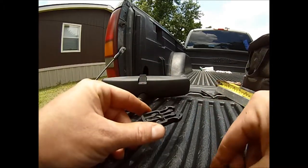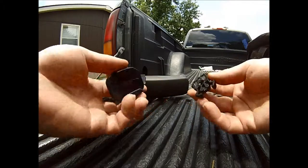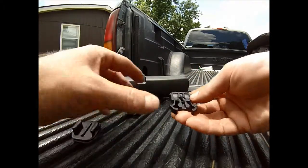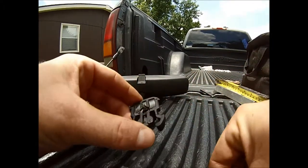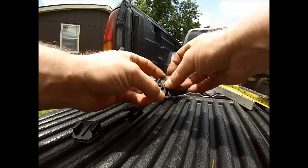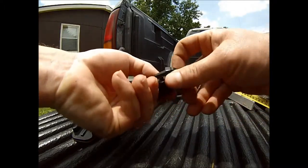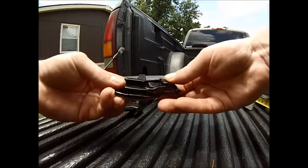The problem that I ran into was this has to be flush, flat — you can't have anything sticking out. So I made one hole and then I took a larger drill bit and stepped it down just a hair, so that way this guy is going to fit flush to this clamp or clip here.